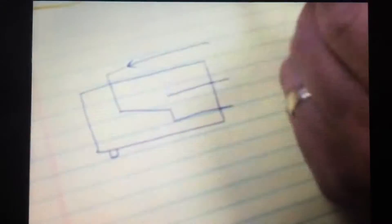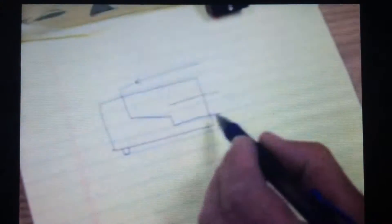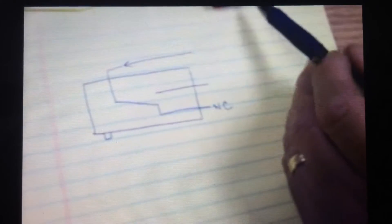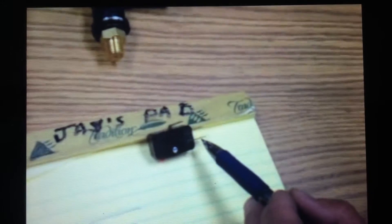The switch is wired — I did a schematic. It's already printed onto the side of all of these pressure switches, but it's kind of hard to see with the camera, so I've drawn it out on a pad. Your inlet power comes into the top, which would be on the top side. You can see the red wire coming in across the top — that's where your power comes in. The power goes in through the switch, and the normally closed position is on the bottom. So if the machine's not running, the power would go in at the top and come right out the bottom — in this case, in the red and out the blue on the bottom.